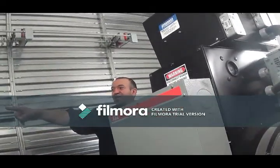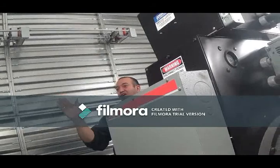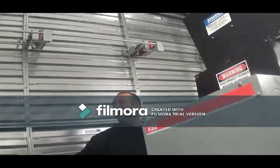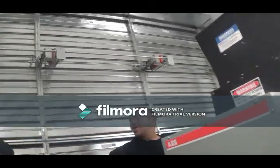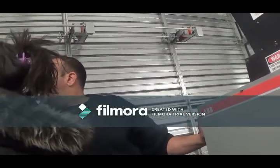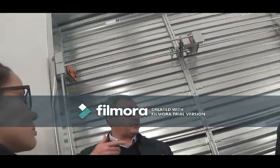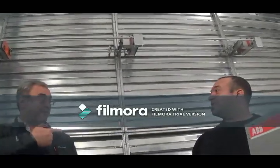So basically there are controls right there that will control at what temperature. At about 20 degrees, they're going to start responding. There may be stickers on those for the set point, or maybe we should mark it with a marker, to make sure that we don't start playing with them. You could mark it, as long as you remember. Anywhere, like, that's a little bit too high, I would say. I would keep it around here. Would you call it for hotter and colder? Let's see if those go open. If you call it now for 25 or something, or maybe 20-something. In time, it'll make a difference, okay? Right? But if we do it right now, at 25, you would expect to see them open, yeah? That's your bet, actually. Yeah.